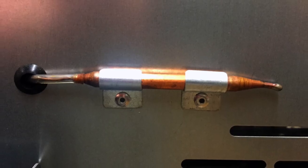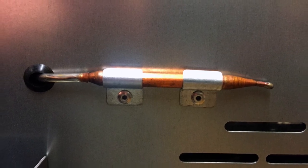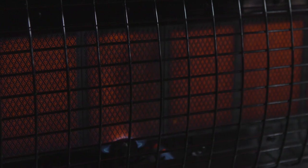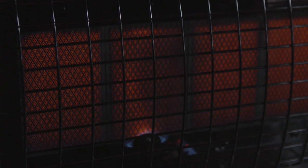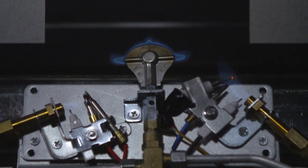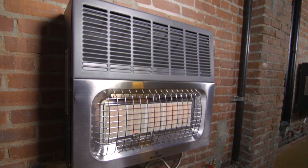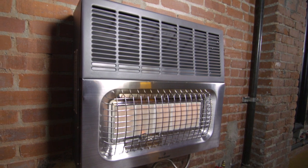The copper bulb located on the back of the heater can be adjusted if needed to provide even better accuracy. Please keep in mind that if the thermostat has reached the temperature of a particular setting, the burner will remain off until the room cools. For example, setting two may only keep the pilot on if the room is warm enough.